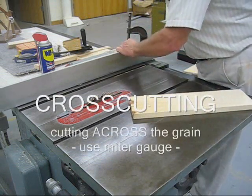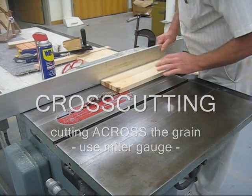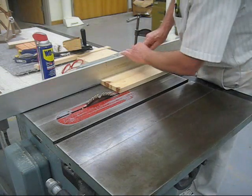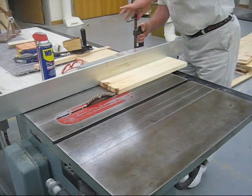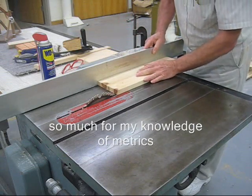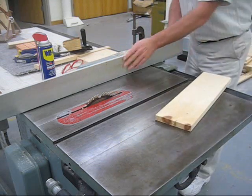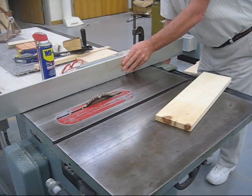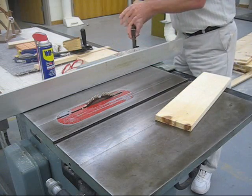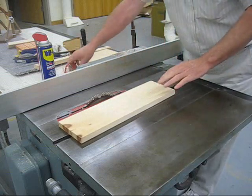That's why they say an ounce of prevention is worth a pound of cure. First, I'm going to have my distance set, then make sure my fence is tight, put my clamp, and clamp the fence down — make sure it's secure. Then recheck my measurement to make sure everything is fine.